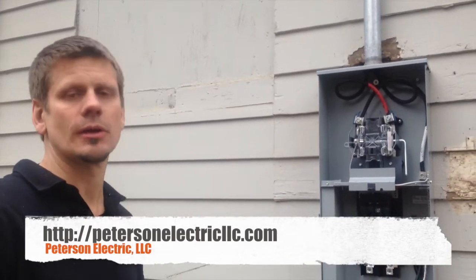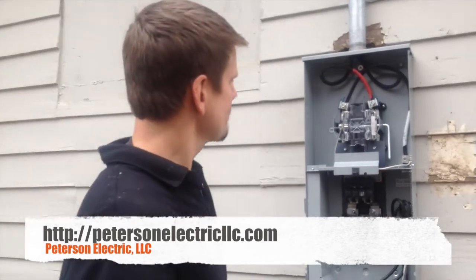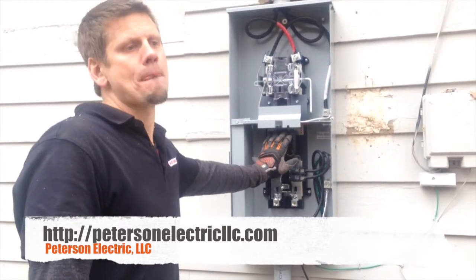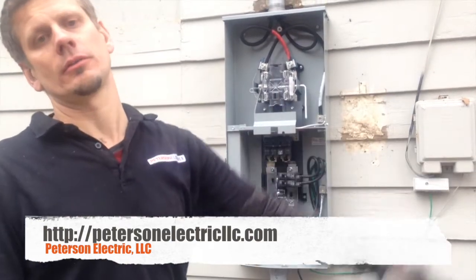And downstairs, we've got to go in the panel yet, and we've got to float our neutrals, because now that this became our first point of disconnect, Article 250, I believe, in around 122, states that you've got to float your neutrals and ground separate on all sub panels.